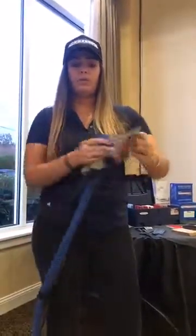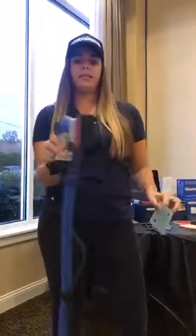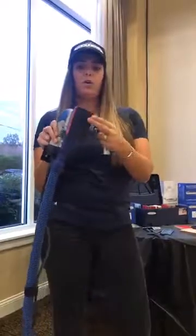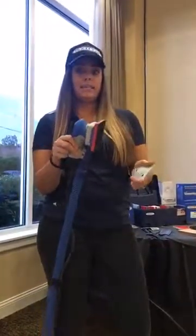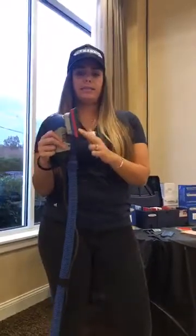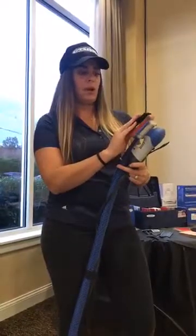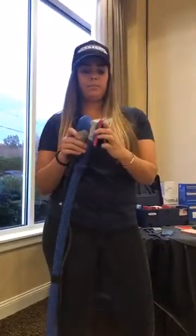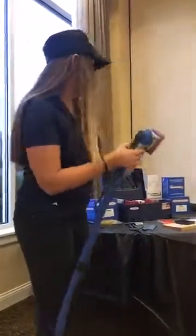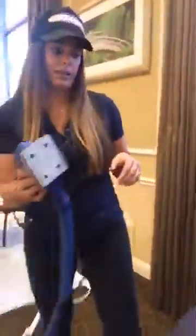We never want to put it directly onto the sander, because when you put sandpaper directly onto a backup pad with hook and loop backing, you're going to create heat, and heat is going to melt these little pads. So we put this little pad saver right on the sander, and I'm gonna put my 80 grit film right here, and I'll show you how this 3x4 finishing tool can actually be turned into an aggressive leveling tool.